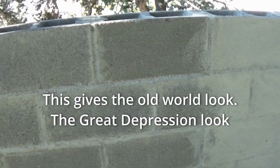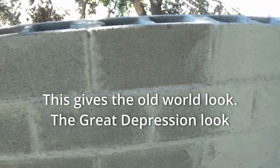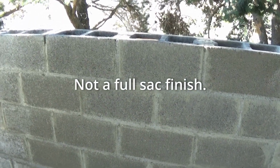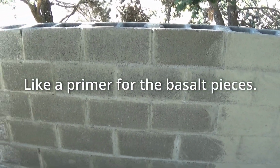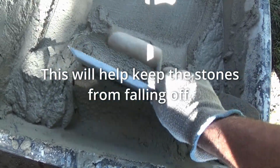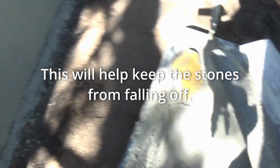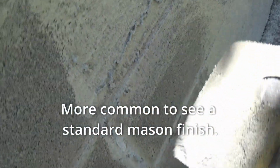Make sure your wall's moist. It's got to be moist. You can see my moisture line right here. So we're doing 3 feet worth. Step one, scrape the wall, prep the wall. Step two, wash the wall. Get your moisture just right. Moisture is important here. Take your mud a little on the thin side. And finish with the sponge.